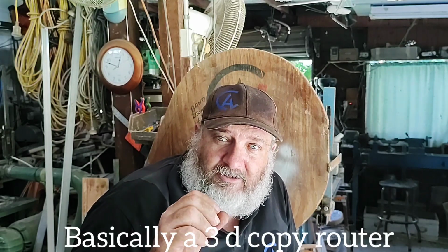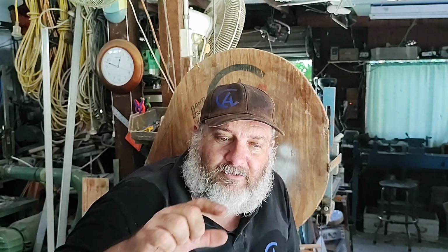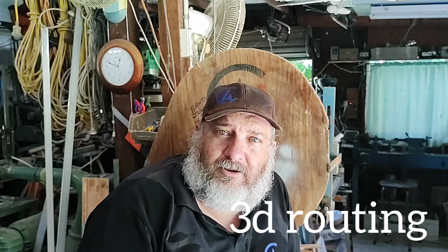Now, if you'd like me to do a video to explain something else a bit better, I may be able to do that too. In the future, I don't know when it'll be, I'll look at doing some offset turning for ovals, oval shape. A proper handle making machine that does that uses a blank template to copy, and it uses a follower, and it follows sort of like a key cutting machine in some ways, except it does cylindrical shapes, and it has a follower that follows and a bit that cuts at the same time. Hence you get identical matches. It's 3D sort of template copying.